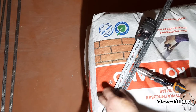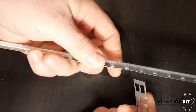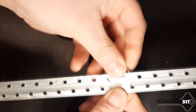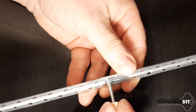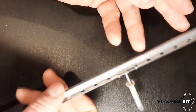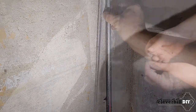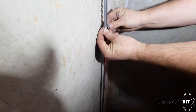After that, I cut the beacons to length so they fit freely between the ceiling and floor. On each beacon, in the upper and lower parts, I fix one clip cremer. The clip cremer is installed against the wall with the side with bent corners, and I bend both its edges so that the beacon is squeezed inside. I fix the beacon first on the top screw, then on the bottom screw, sliding the clip cremer onto each from the top. After that, fixing the remaining clip cremers on the beacon and sliding them to engage with the screw heads is straightforward.